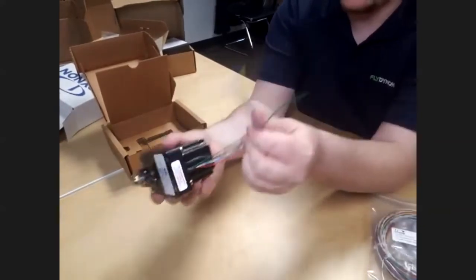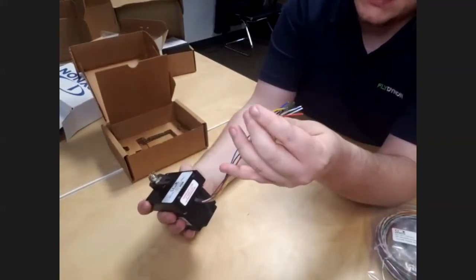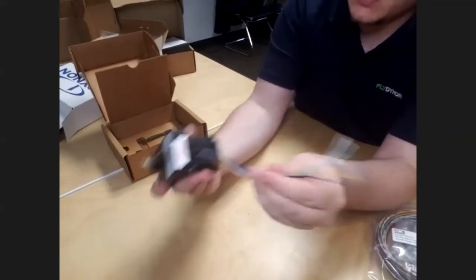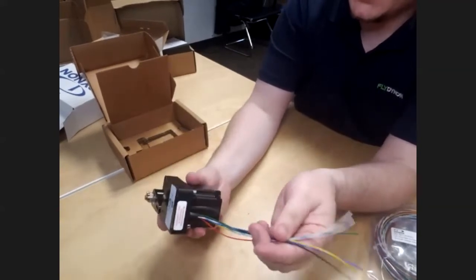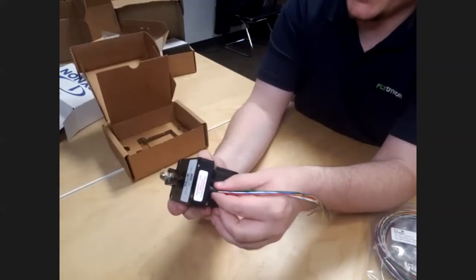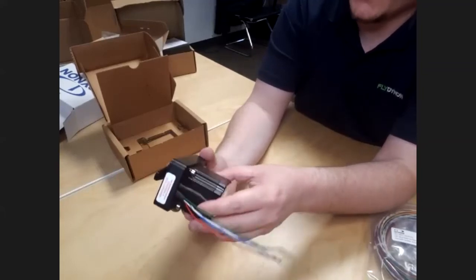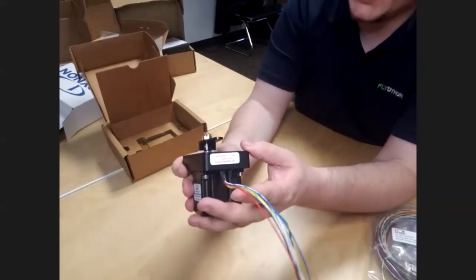It comes with a length of wire for the, I believe it's seven. Yeah, seven wires. These are a SkyView network connection. So they plug into the five-port hub. That's why many autopilot applications need at least one five-port hub, if not two, to have enough connection ports for all the servos, especially if you have roll, pitch, and yaw.